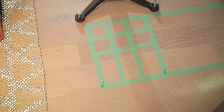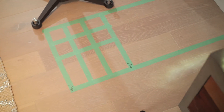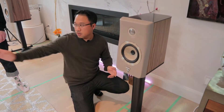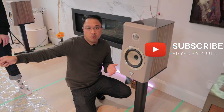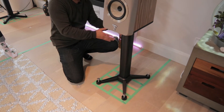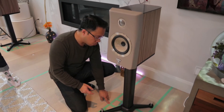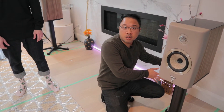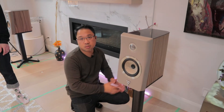The reason why we did a maximum line on here is that it's aesthetically pleasing in the room and will keep your family happy. What we're going to do is sit from the listening position and move the speakers five inches back — we marked these in two-and-a-half-inch increments. What you want to listen for is the bass response. If the bass response gets more boomy, you're going to want to move the speakers back forward. If there's no difference, you might as well keep them further back, as it also looks nicer in the room.